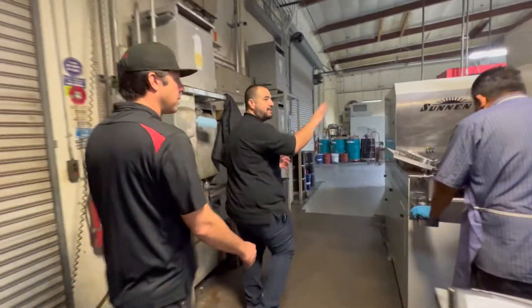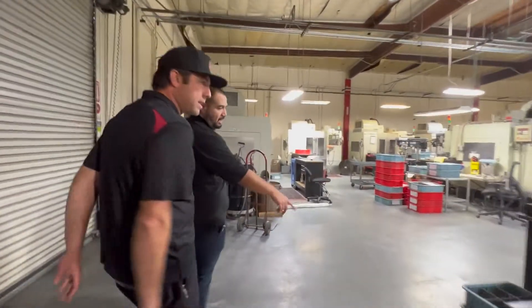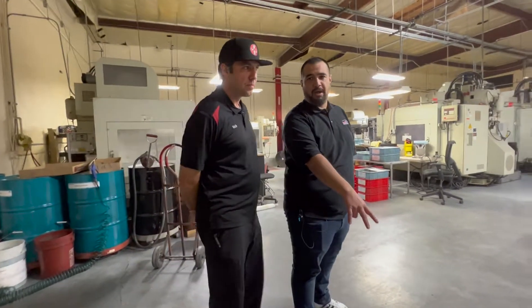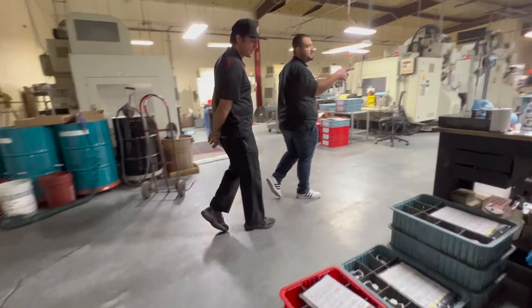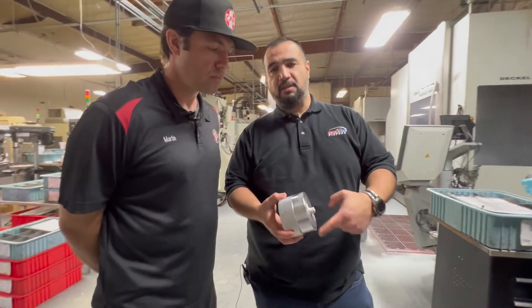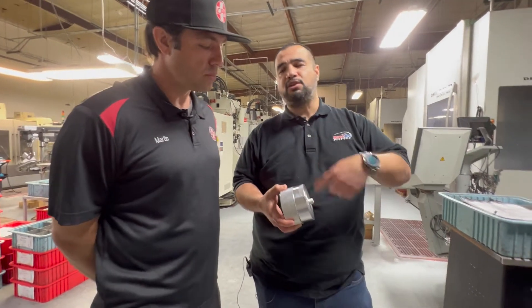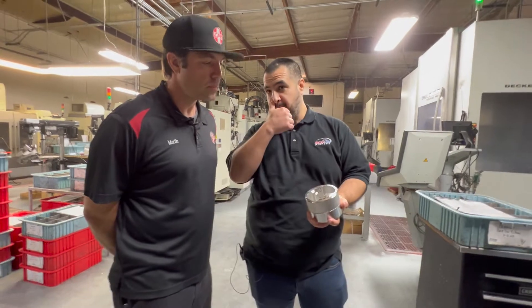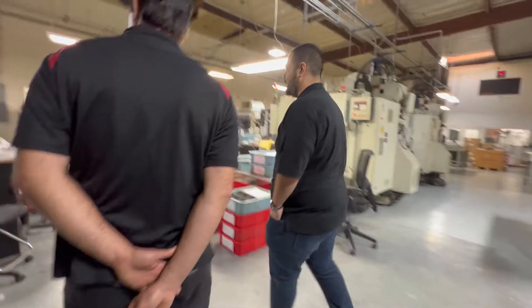This is the end of the progress — so once you pull the forging, they'll come here. This is where life begins. They start off in a traveler, eight to a bin or 16 to a bin depending on how many you're buying. It'll come to the machine here. You'll start cutting it to the right outside diameter, just slightly bigger than it has to be, turning it into the shape of an actual piston and shaping the bottom as well.